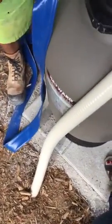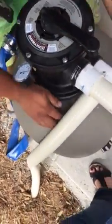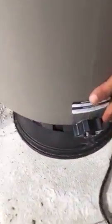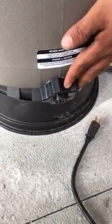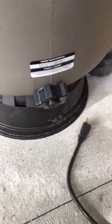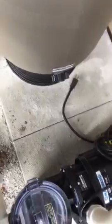Oh, I see. Yeah. So with winter mode here, there is a drain cap, which is on your side down here at the bottom. Come closing time, you're going to take this off while it's on winter mode, and leave it off for about 2 days. It drips like a leaky faucet, just a constant drip. Once it finally does stop dripping, you leave the cap off and you flick it to closed mode. Okay.